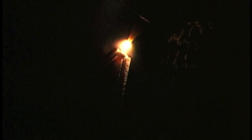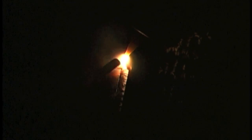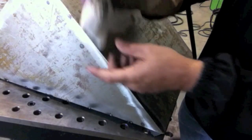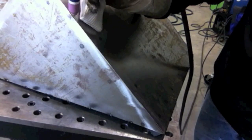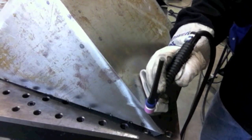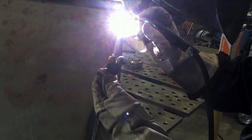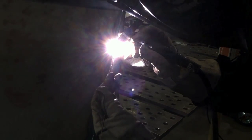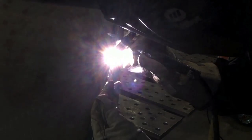Lighting up where I left off. I just want to use just enough heat to melt the corner — that's really about it. If I go a whole lot hotter than that, things are going to get a little squirrely. This is a little more heat than what's necessary but I'm in the ballpark, actually only using about 55 to 60 amps. Going by that rule of thumb of one amp per thousandth, that's a little less than the 63 thousandths of the thickness. I'm using the TIG finger today — it's pretty awesome for jobs like this because your pinky will get hot propping next to the weld, and the TIG finger lets you slide long distances before your fingers get too hot.